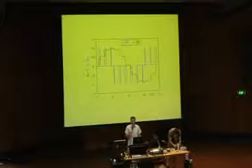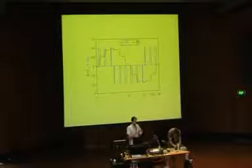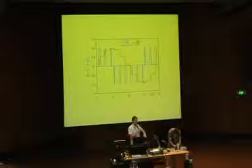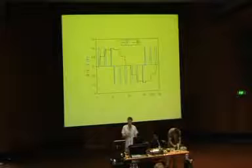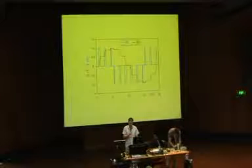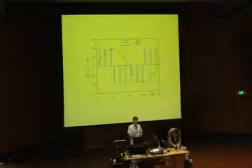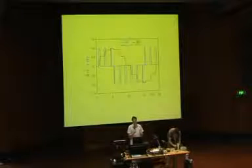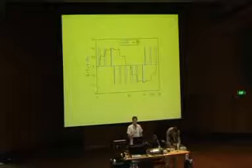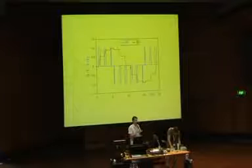Digital devices are really, really bad at doing analog work. And so pulse width modulation is a way of simulating an analog output, or sending a signal that says, I want this proportion of the output to be on. And it does it by basically having a square wave. And you can see in this particular diagram, the blue line, the V line, is the actual voltage. The scale on this is obviously a bit odd, but basically it's a logical 0 or a logical 1. And so the output can be either off or on. And by varying the time that it's on, you can vary the representation of the value between totally off and totally on. So it's a way of faking analog output.